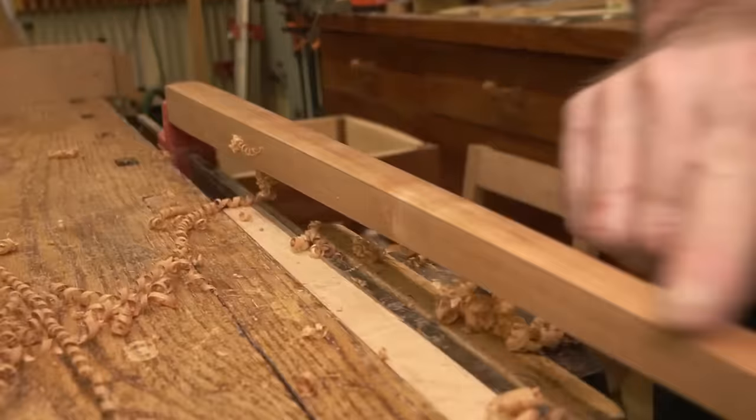And check this out. This is just a teaser of how you start with the leg. It starts as a block. This is an 1¾ inch square block of mahogany. And then it gets sawn to this nice curving taper, and then pillowed to give it the full treatment. So we'll be talking about veneering and laminating over a form for curved forms as well. This is gonna be a lot of fun.